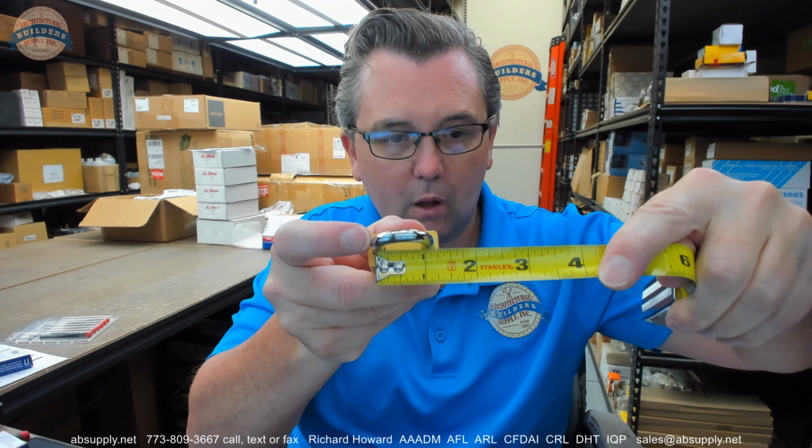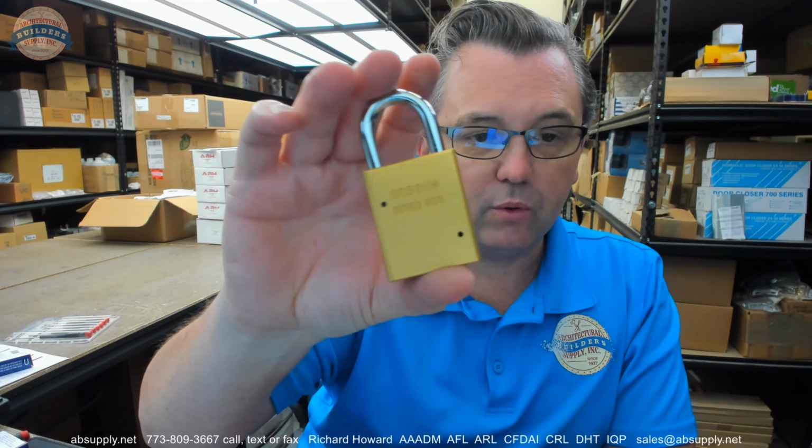The width of the shackle looks like it's about 7/8. Let's check the diameter of the shackle. 0.25, so 1/4 inch shackle diameter. Okay. Pro Series yellow. Let's switch to the screen view where we can take a closer look at the supporting documentation.